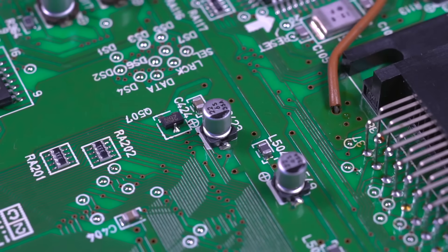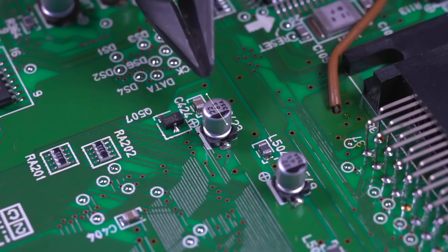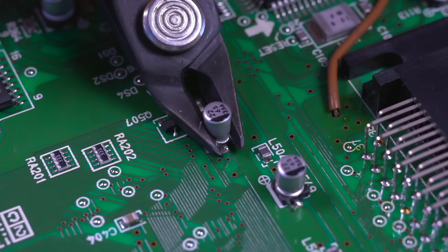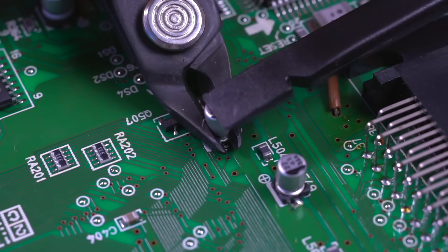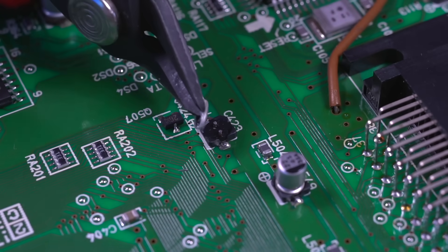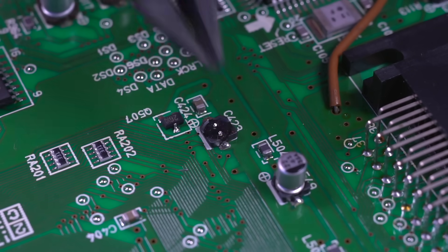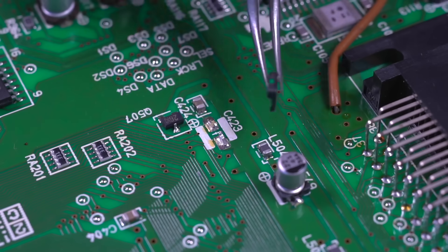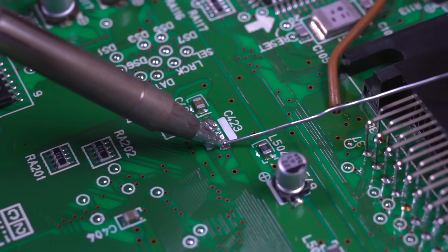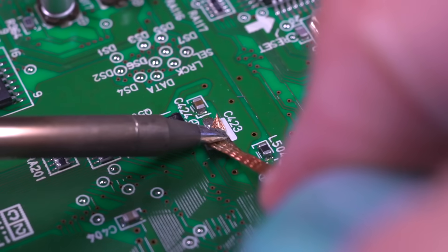This next method of removal is a bit controversial, but I find that it works pretty well and I've had good luck with it. It involves using flush cutters. What we can do is cut the aluminum can near the base, but we need to cut parallel to the leads. The idea is to put as little stress on the leads as possible, thereby reducing tension on the pads. I place my spudger on top to place some downward pressure, as well as prevent the can from flying across the room. Once it's cut off, remove the bottom part of the can, then trim the top part of the leads, as this will help allow us to remove the plastic base below. Then apply some flux as well as some fresh solder to whisk away the remaining part of the capacitor legs from the pads. Clean the area and then use some wick to remove the old solder from the pads.